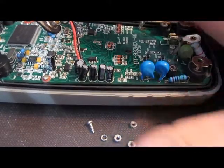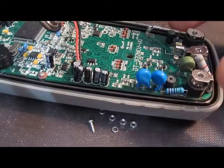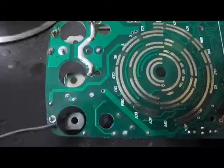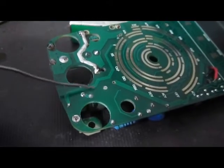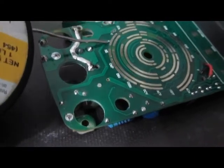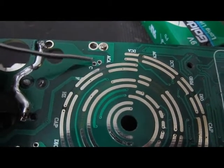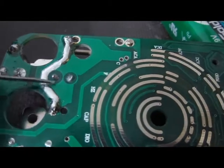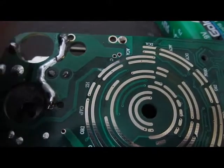Let's look at the damage that transient caused. Here are pictures of what the meter looked like after I damaged it with the original generator. This is the input pin, this is the common, here's your high voltage resistor, little PTC down here — these two are connected directly to each other. You can see this trace comes all the way up around into this leg of the selector switch, and then what ends up happening is this very corner tip arcs over to the common point, eroding that part of the switch — which is why we're seeing these two vias light up.